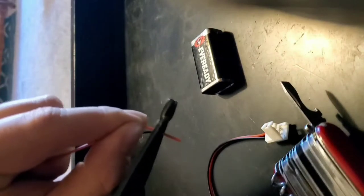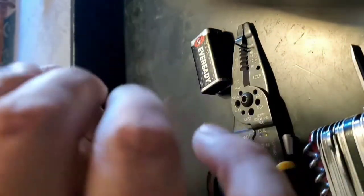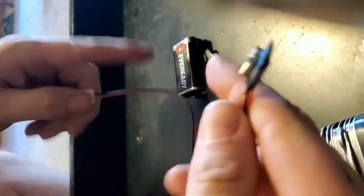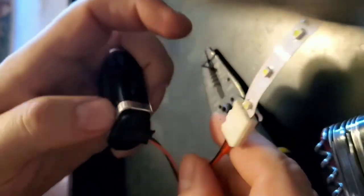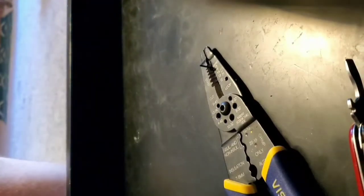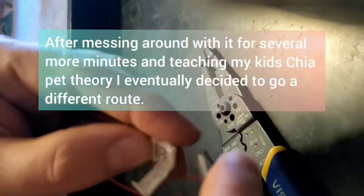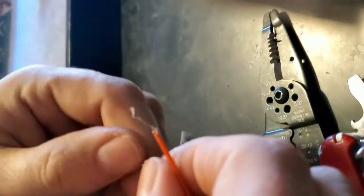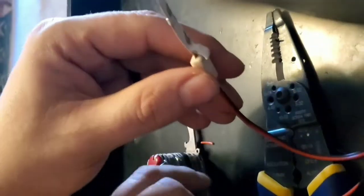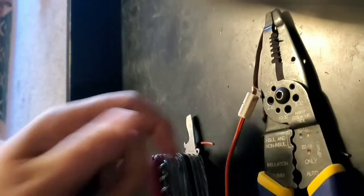Let me take my wire strippers and remove the plastic coating off both wires, then twist up the ends to keep everything nice and neat. Now it's time to try it out — and voila, it doesn't work. This brand of LED harness came with a plastic connector at both ends. Once I realized there was some kind of issue with the connector, I decided to just clip it off and hardwire it in directly. Pro tip: I always loosely put it together and test it before I go through all the effort of wiring it up properly. I'm glad I did, because after hooking it up it still didn't work — I found out the color coding was off.